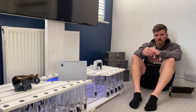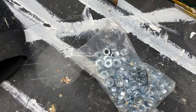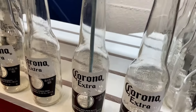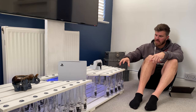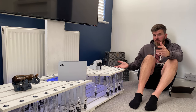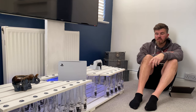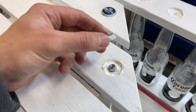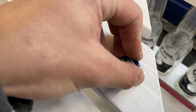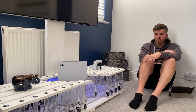I used six millimetre stud — or threaded bar as it's called — and six millimetre nuts. Because I've got the six mil hole in the top and six mil hole in the bottom of the bottle, one stud and two nuts, I can then bolt it all together. That gives it a nice solid structure. You don't have to tighten these like mad, but once it's all bolted up it's really solid. In hindsight I probably would have drilled a few more bottles, because with a good drill bit they weren't actually that hard to drill. You measure up your stud to your bottle length, cut it, then put the nuts on either end and tighten it all up. You'll then be left with the six mil nut on the top, and you can just use the bottle caps — hammer them on gently — which covers the nut that holds it all together across the deck.